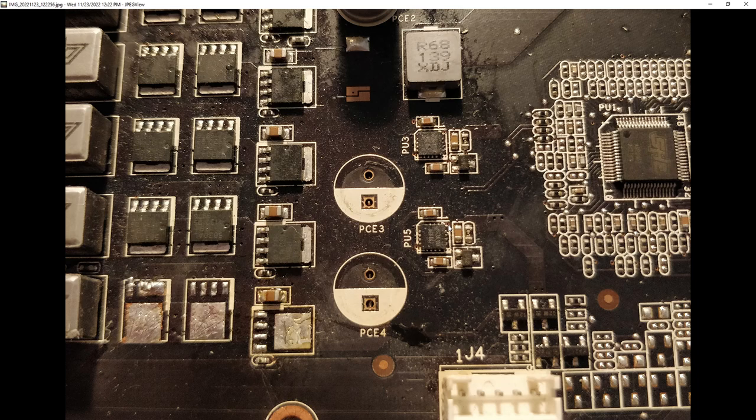I did manage to do some research: while I couldn't find documentation for the UP6282 drivers, I did find pictures of an ASUS GTX 560 Ti that uses the same UP6282AD drivers as the MSI card, and the passive component arrangement was the same. At that point I was like, okay, these are almost certainly pin-compatible — I'll go for it.